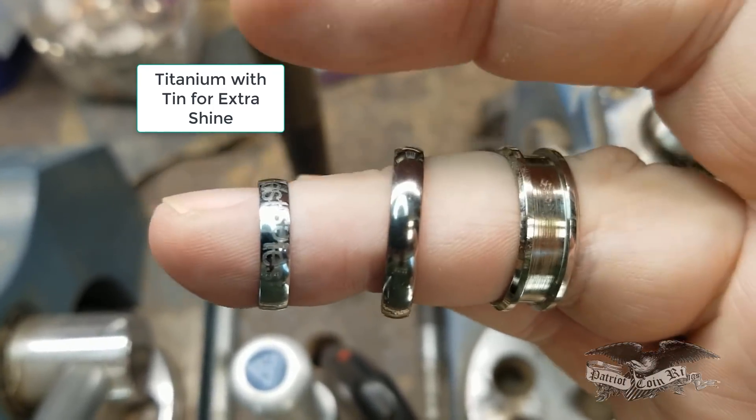Now let's test straight steel. Notice how it's red-hot right now. I've got a reading of 361 degrees and still no anodization — just a burn mark. It doesn't anodize the way titanium does. Dip it in water and look — no anodization.